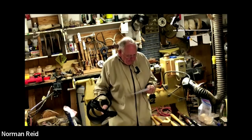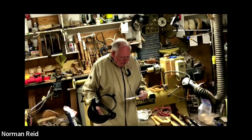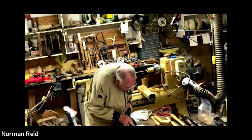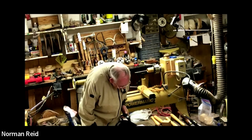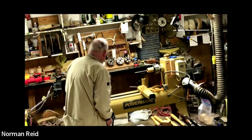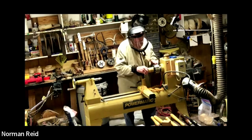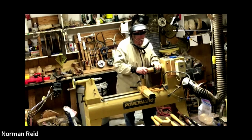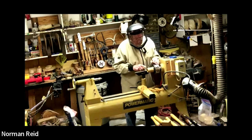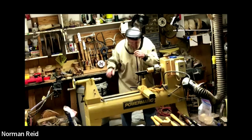Okay. So I made it. Okay, so we're gonna sand and polish and finish the inside of the base. Except I'm not gonna do that because I'm gonna do the fit. So we want to fit the lid on tight. That's what we're about to do now. And to do that, I need my good old bedan tool. There it is. Put this on. Oh yeah, that's gonna be nice. Okay, so I've got a good burnish mark there, so I know exactly what the diameter is of this. So I can now sneak up on a good jam.